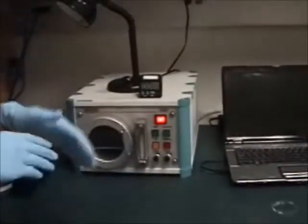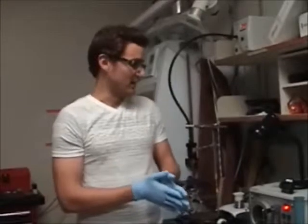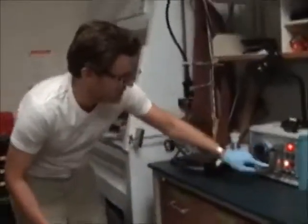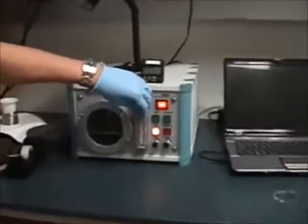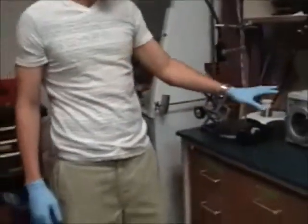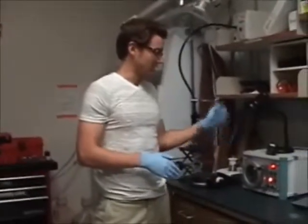This is where it depends on what you're trying to bond. Everybody has a slightly varying protocol depending on their specific devices, how rough they are, and the feature specifications. We'll show different testimonials at the end. So we hit gas, and this is where you can adjust the flow — everybody tends to do it slightly differently. For this part, we turn the flow up to about 30, and set the timer for two minutes. Generally people do two, maybe three minutes for this part.